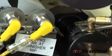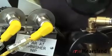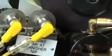Burnishing is the sliding action through a gear's operating pressure angle range, encompassing the tip to the start of the active profile. It is a rubbing action which takes the plus material and either knocks it off the tooth or refinishes the surface.